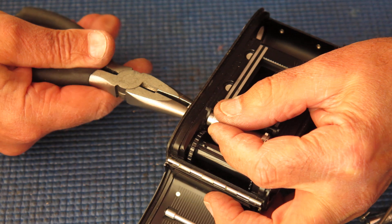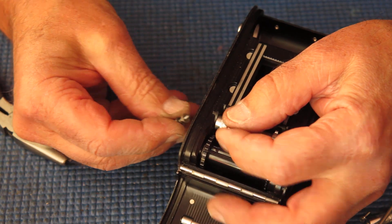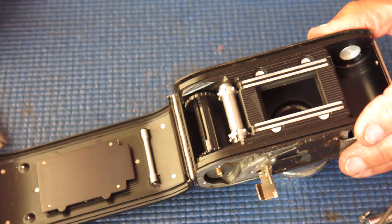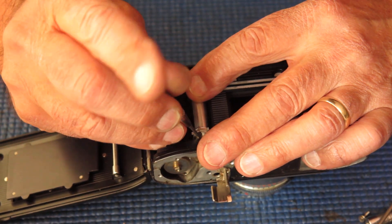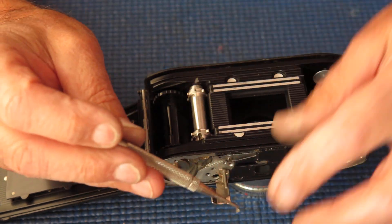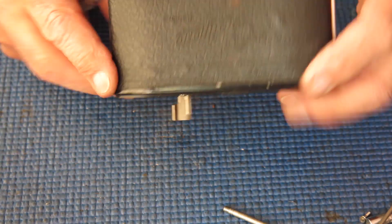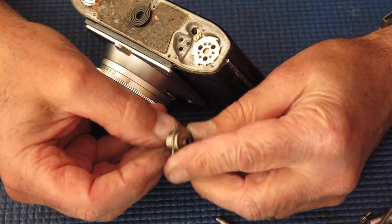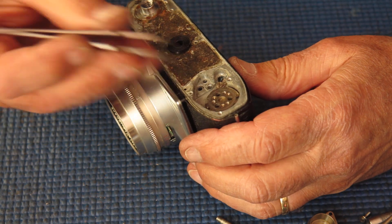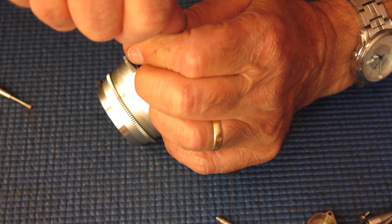We're in business. The rewind button is well coated with glue too, so whoever was applying the leatherettes had them nice and wet when putting them back on. Remove the screw from the sprocket shaft — that was a little bit loose — and take the sprocket shaft and sprocket out. At the base of the camera there's our clutch, the guide for the film advance shaft, and our clutch assembly.